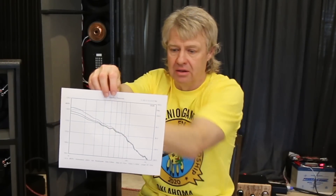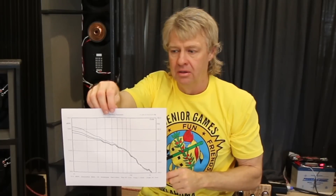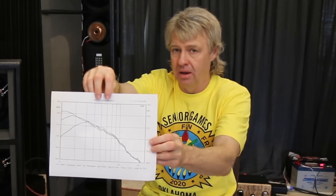The bottom end of the scale is here and the top end here — this is where the crossover control is pulling the top end down. There are three lines: one a little higher, one in the middle, one a little lower. Those differences are created by changing the damping. We can go from high damping to low damping to medium level damping, and we can change how tight and how fast the woofer is controlled. It can really slam on the brakes if you want it to. Another graph also measured right on the woofer shows three different lines — the difference being the extension filters. The top one is the extension filter set to 14 hertz, the middle is set to 20 hertz, and the lower one is set to 28 hertz.